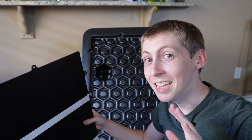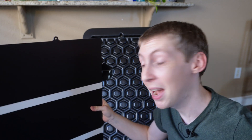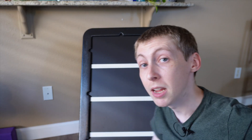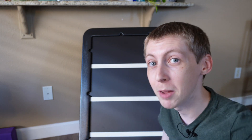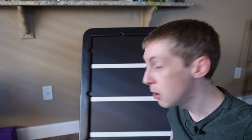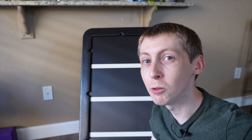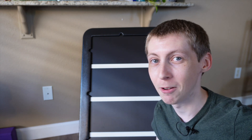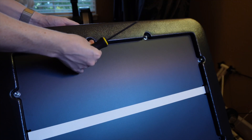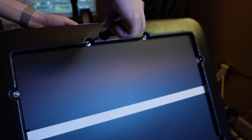The last major step of the initial assembly of these backdrops is attaching the backdrop front to the backdrop back. I received a pro tip from Jim — shout out to Jim, a mentor on teams 9277 and 10650. When you're putting the bolts into this assembly, make sure that you place all of the bolts before you tighten any of them down. Once you tighten one down, it can be difficult to get the other ones in place. So place all of the bolts in first, then tighten them down one by one.